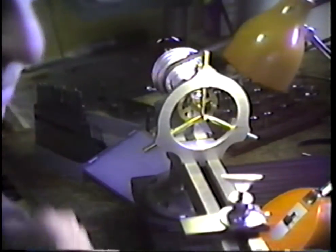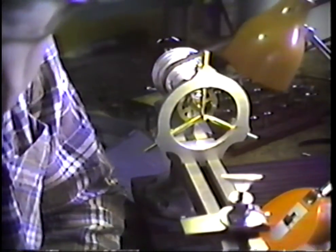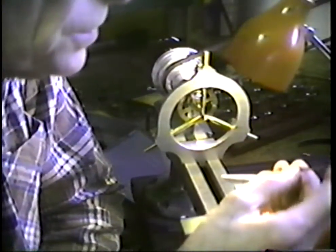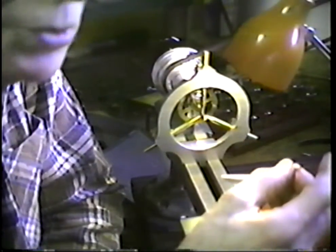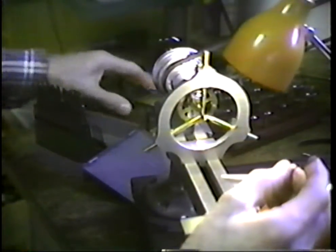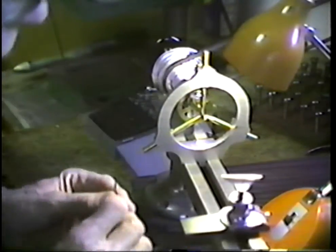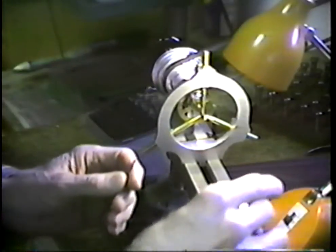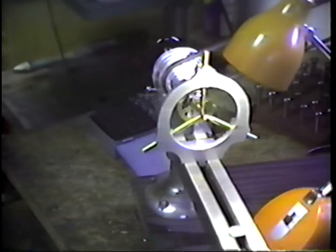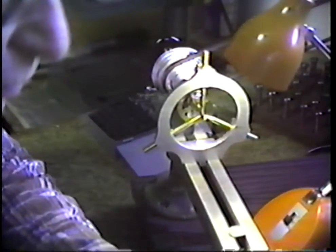Suppose that in this situation we just drill this with the 72 or 73 thousandths bit. The bit will over drill slightly, and that should give us a little space to finish out the pivot. So let's just use this bit for the purpose. Go over here in the toolbox and see if we can pick out something to hold this drill